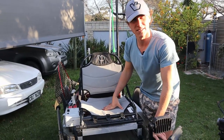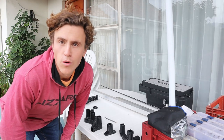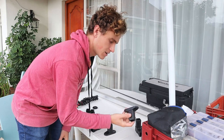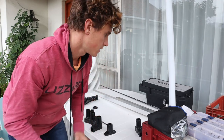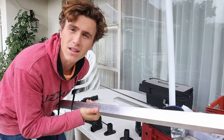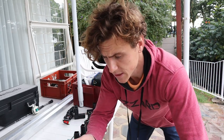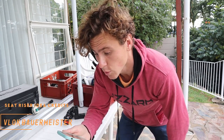As you can see the seat is lifted. It was really easy to build — like building Legos, honestly. So all you need is four three-way 38 millimeter connectors, four one-way 38 mm connectors, and then 2.2 meters of 38 mm aluminum tubing. Before cutting, you need two 47 centimeter pieces and four six-and-a-half centimeter pieces.